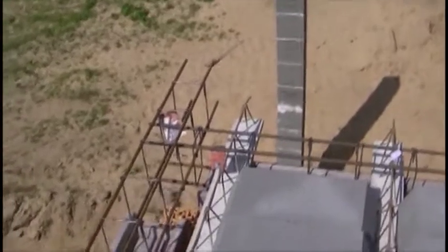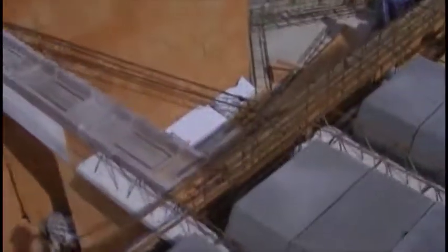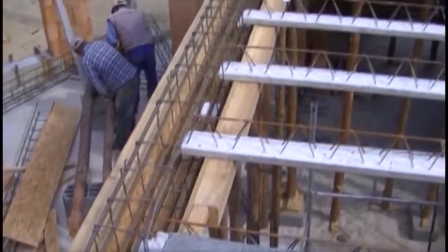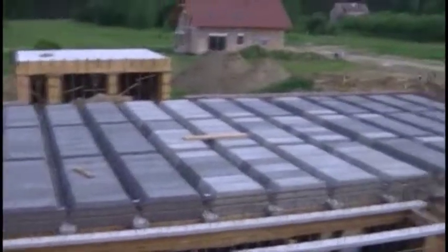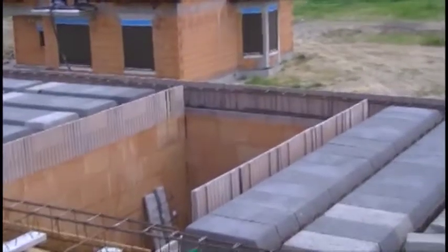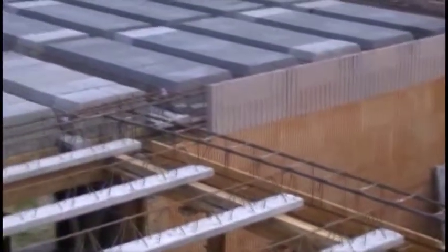The rib is a reinforced concrete structure in the form of monolithic beams surrounding the entire building, which is designed to strengthen the load-bearing walls and provide support for the joints and the entire ceiling. Note that the beams are inserted inside the reinforcement and slightly raised so that they are accurately formed by concrete. In our case, our rib will be about 28 cm high and will be reinforced with 4 rebars of 12 mm diameter. This is very typical in single-family housing construction.